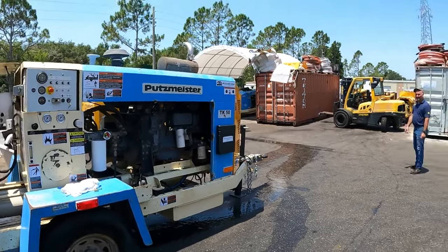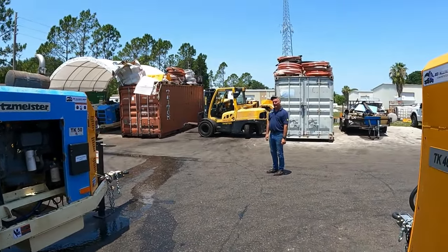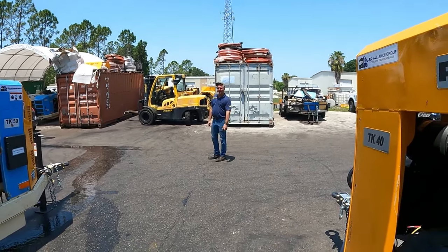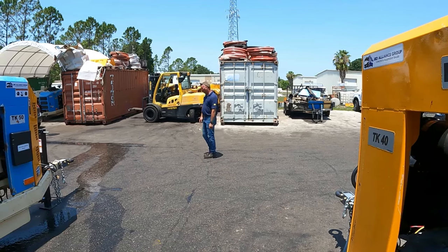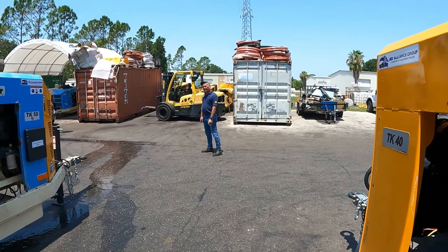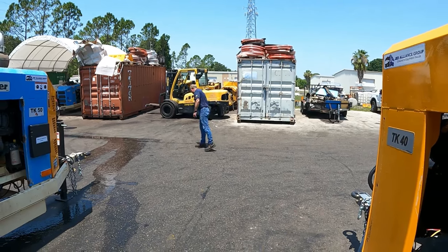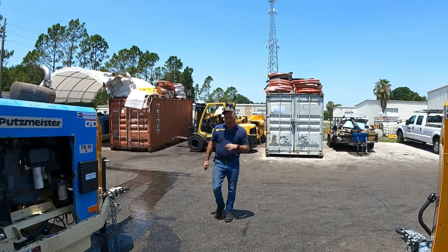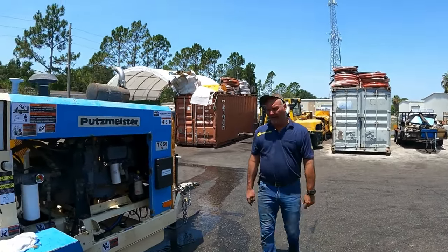if the light is solid, it means you got an interruption somewhere. Someone's got a 900 megahertz radio around you, one of them two-way radios, a pager, that still exists, something that works on 900 megahertz. Something close to you. Usually an airport will do it. Usually the tower's using a two-way. If you're working around something commercial like a power plant or coal mine, they usually give you a problem. Any other time, no.